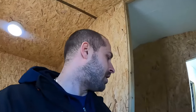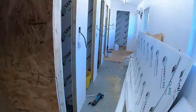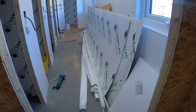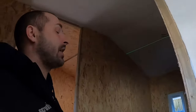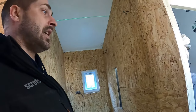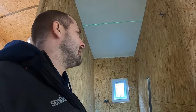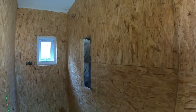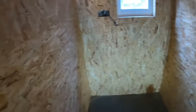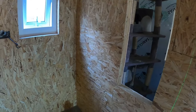Hi everyone, it's Artis from N Carpentry. In today's video I'm going to show you how I've been sticking the semi-clad boards, or hygienic wall and ceiling cladding boards. I've done all of these on my own, so I've worked out my own way of doing it. First of all, what you're going to need is a laser level so you can see the lines — because if your outside wall isn't straight, that allows you to cut it to shape.